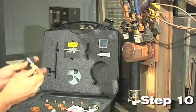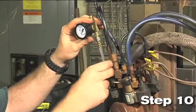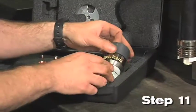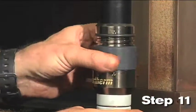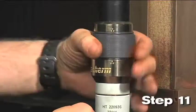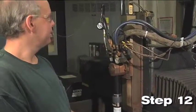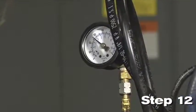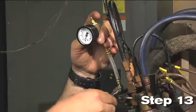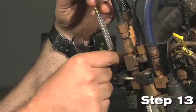Step 10: Install the pressure gauge included in this kit between the plasma gas line and the off valve assembly. Step 11: Install the torch on the quick disconnect receptacle using the torch alignment feature to easily lock into place. Turn the threaded collar on the torch until it is tight. Step 12: Verify gas pressures for the appropriate current and process, and verify that there are no leaks. Step 13: Remove the pressure gauge that was installed in step 10 and the installation is complete. You are now ready to perform some test cuts.